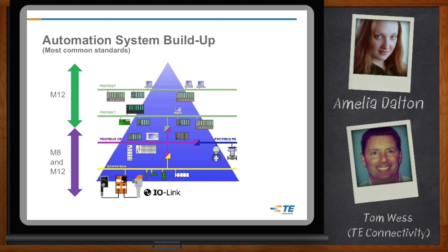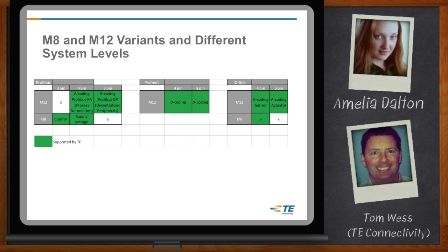So which combinations and configurations do you support? For an M8, you would be looking at a 3-pin and a 4-pin configuration. For the M12 connector, you're going to have a 4-pin, 5-pin, 8-pin, and 12-pin configuration available. The other big thing when you talk about M12 connectors is the keying features known as codings — A codes, B codes, D codes, and an X code connector that is out in the market.